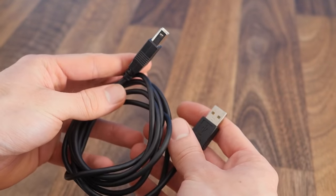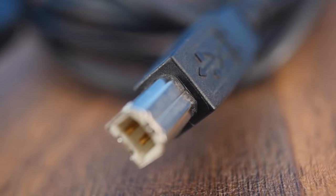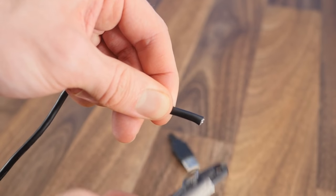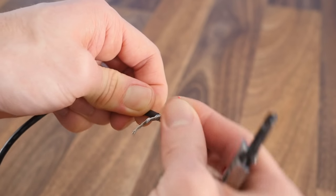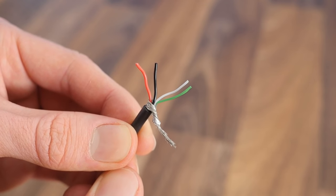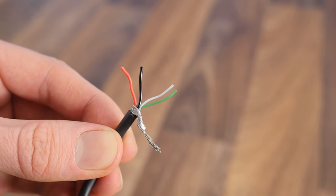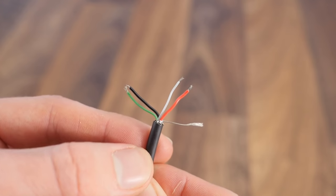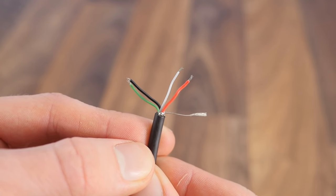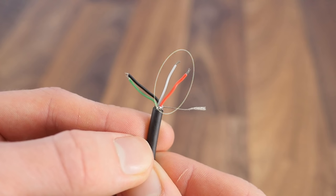To transport the audio signal we'll need a USB cable. It doesn't really matter what connections it has on either end, as these need to be chopped off so we can access the wires inside. The fact that USB cables have five individual wires makes them perfect for this project, as we need to transport the audio both to and from the volume knob. So after trimming the wires, we need to group them into two sets so that we can wire them up correctly later. Here I'm grouping white with red for one audio channel, and black with green for the other audio channel. The ground wire can just be left on its own.